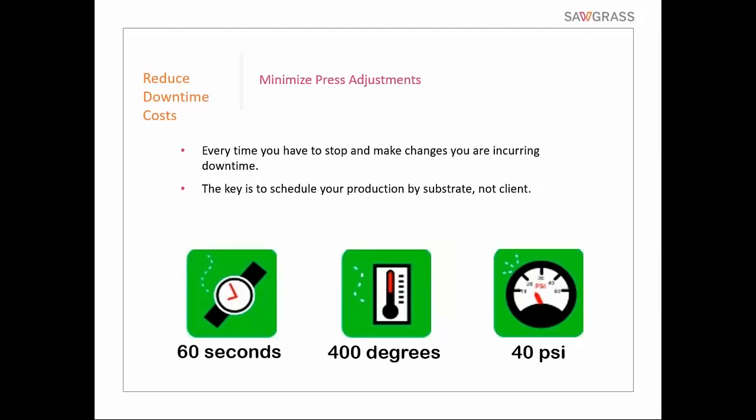And you know, definitely read the manufacturer's recommendations. But certainly when we talk about things that are different thickness, for example, if you did a metal photo panel, it's very thin. If you're doing a t-shirt, it's very thin. But if you went then to a wooden plaque, it's a lot thicker. We're going to have to change the pressure of the heat press in each situation.